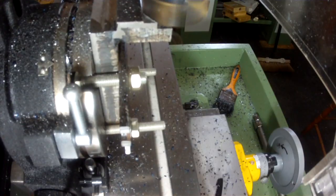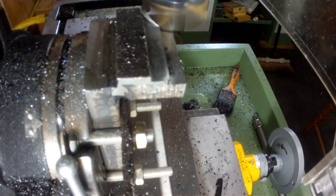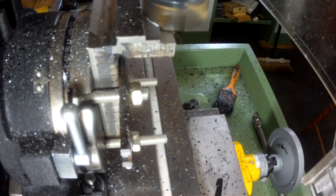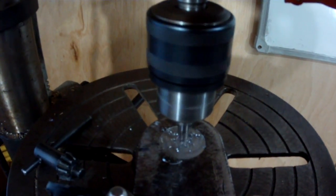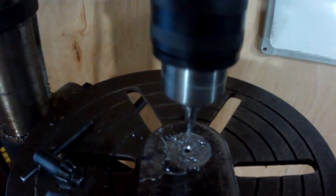The other bracket has a slot key on it going in the opposite direction — at 90 degrees to this one. Both of the slot keys are finished off camera a little later. Here I'm drilling the 13-millimeter pivot hole; you'll notice the face has already been pre-machined.